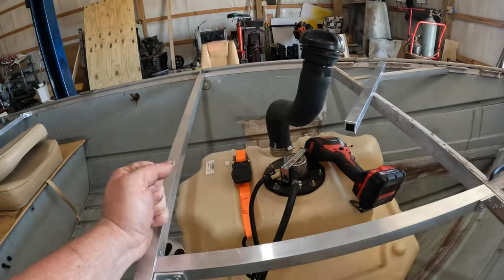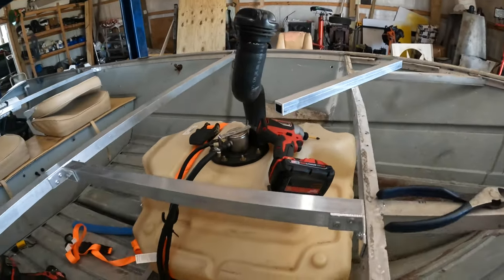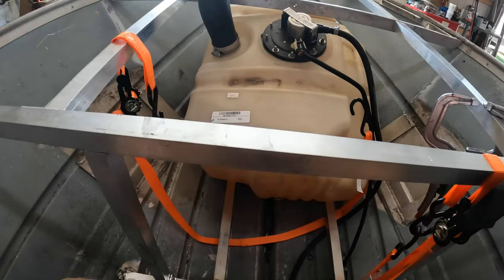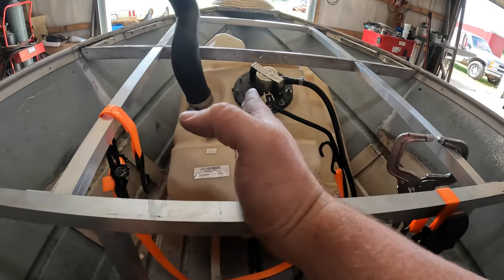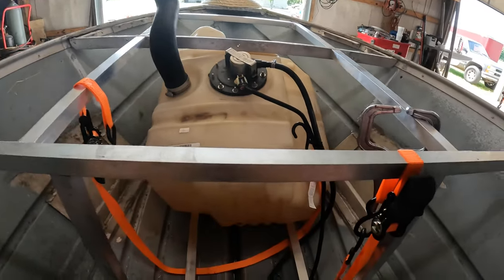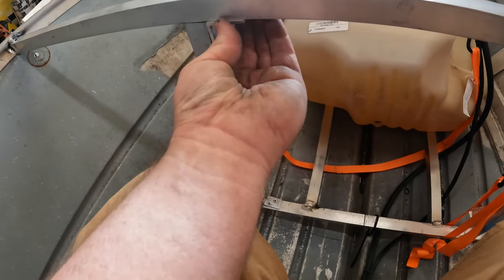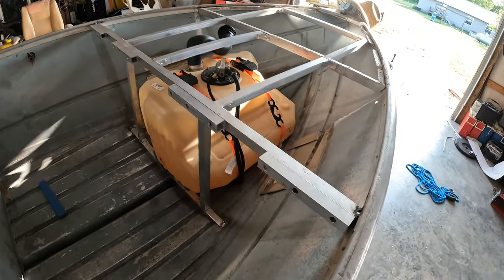Hopefully this back bar will be solid enough that if we cover this you can sit on it or walk on it without it collapsing. Still working on the framing up front — got the bottom of this one riveted in, getting ready to do the top. I went ahead and got the top pretty much done. I think I'm going to run one more support around the gas filler, which will get cut off. We'll get this piece of angle clamped in here, drill some holes, and put the rivets in. Got all the bracing done on the boat, with these little dummy pieces here so that the wood can come out far enough to cover the gas tank when we do our upright piece.